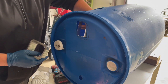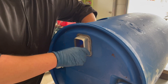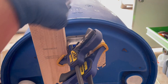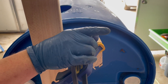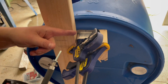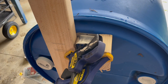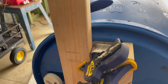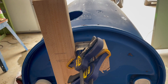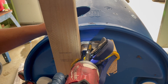You can see the shape of the gasket coming together — this is a custom gasket. I could have just used some sort of liquid gasket in a tube, but I'm trying not to add anything too contaminative to this water — I'd like it to be as clean as I can get away with. Here are the parts: two of those gutter downspout attachments and one rubber gasket I just made. I'm sliding it over, fitting it inside the tank, then sandwiching it with the one on the outside. I've taken a clamp and some pieces of scrap wood, pushing the bar clamp through the inside to pull in the inside piece of metal and then pull in the outside piece of metal.